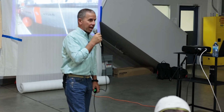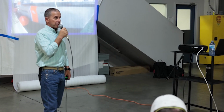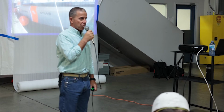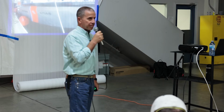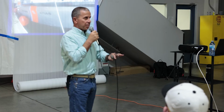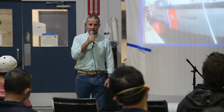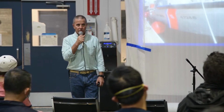When we paint it, we can actually make the corrosion scenario worse. Because if we paint it and then breach the paint, as we will do, it's inevitable somewhere on the structure or on the vessel, once water gets beneath that coating, it puts us into the wet, low oxygen, poultice corrosion situation. So when people ask me about painting components that are aluminum, thinking that they are adding corrosion